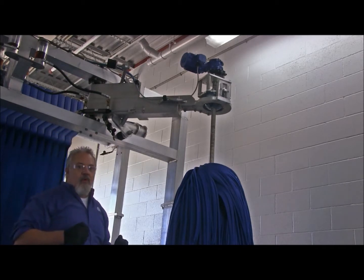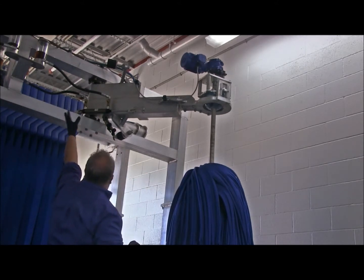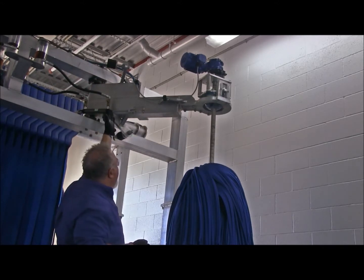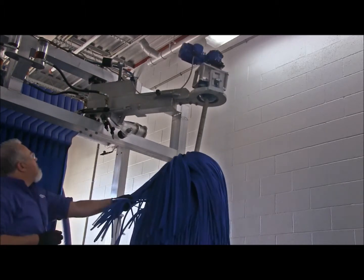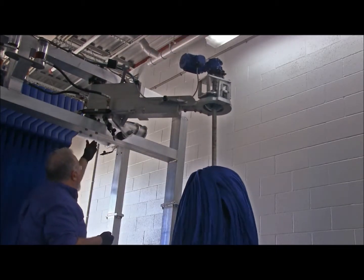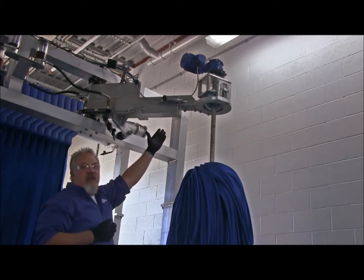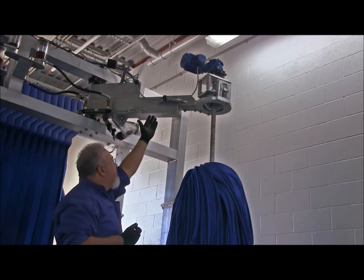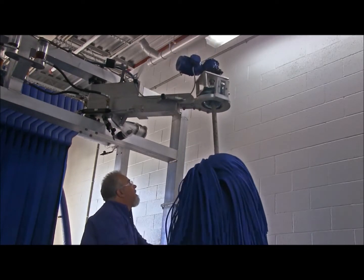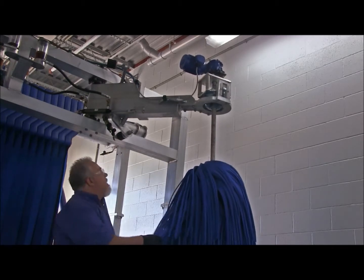And just a quick overview, okay? Because I know you guys got it. Again, we want to take a look at the hoses going into the cylinders, making sure they're not leaking. Follow that electrical wire from the top of the gyro frame down, and let's pull that arm in. Let's let the arm go back out. Make sure the bump stops are in good repair, they're good and tight. Follow that electrical line down to where it connects to the bottom of that motor. When it connects to the bottom of that motor, let's move that brush side to side, front to back, and let's make sure that that wire is not too tight, okay?